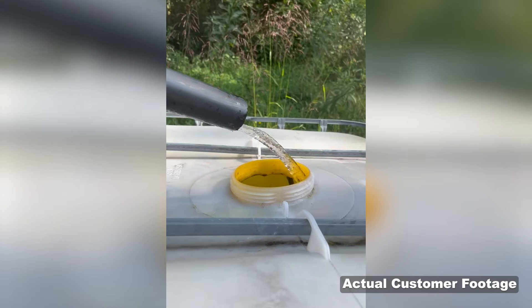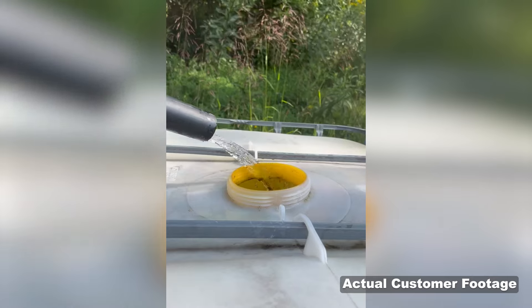There are other times where we need to pump a large pumping head — say, up to the top of a hill from one storage tank to another. In those cases, we might take the submersible pump with a high head pump end and put it down on the tank, pumping from one tank 500 to 1,000 vertical feet to where that water is needed, without requiring the positive pressure we get out of a storage tank.